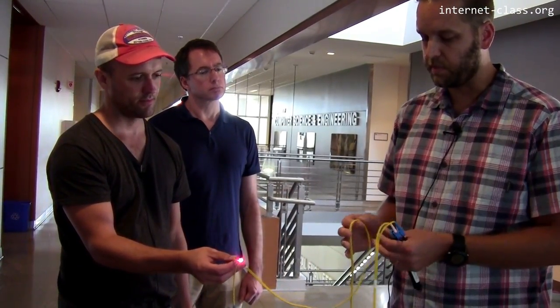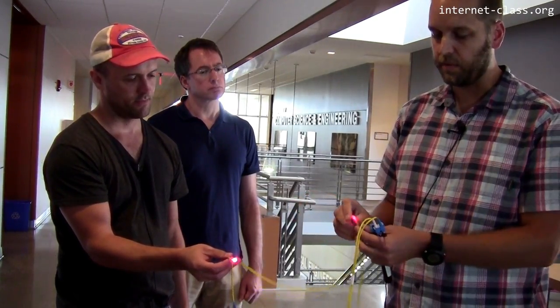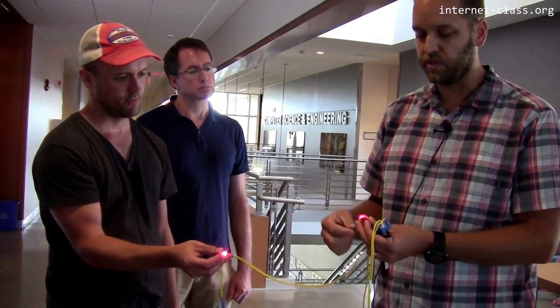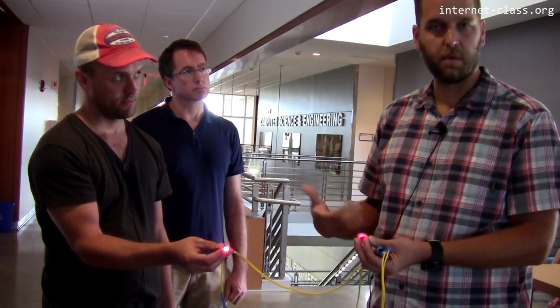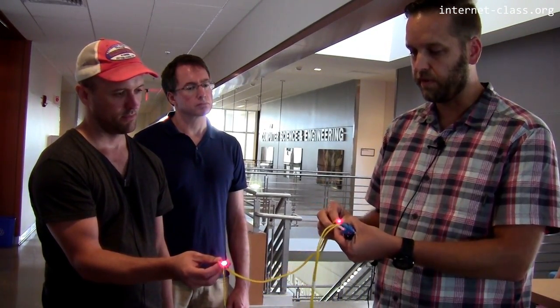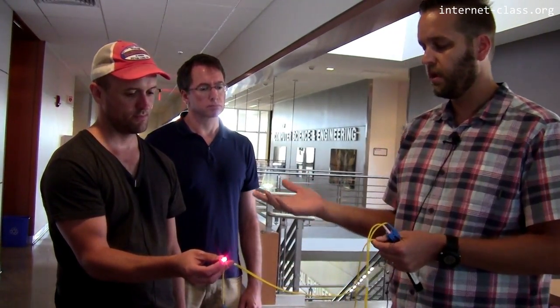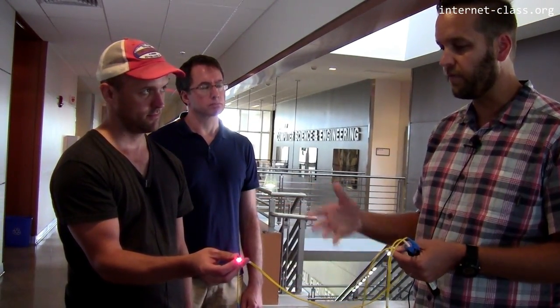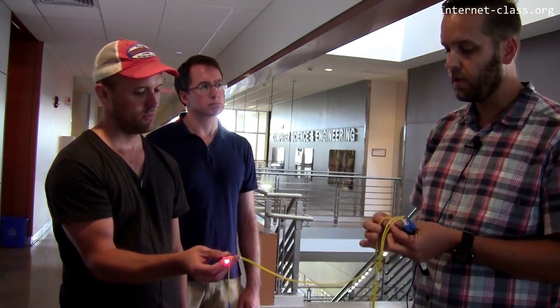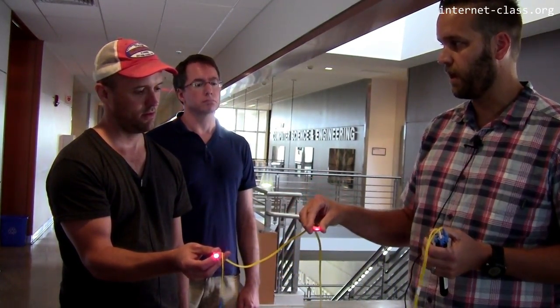There's also a security implication, right? Yeah. One of the things we were talking about is since you see the light escaping from the side, in secure networks, they're concerned with somebody going into a cable that might be underground and actually kinking the cable like this and putting a device and capturing any data going across there. So it is much more secure. There's no EMI or EMF energy coming off the cable, but like I said, if you have physical access to it, there are devices out there that can grab data.